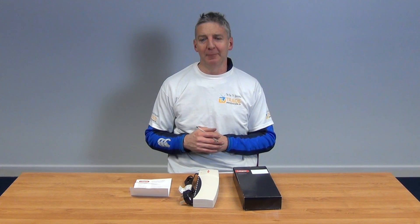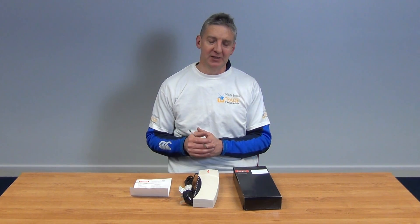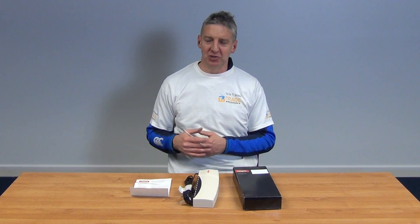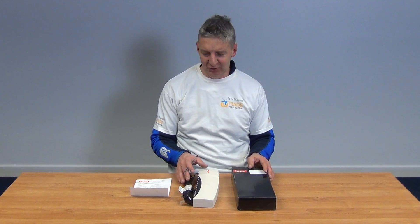Some key points on it: it's a distribution amplifier with bypass. The significance of that means it can be used for distributing and taking feedback from sky eyes. It's also got a tetra filter built in, which is also very important for avoiding interference.